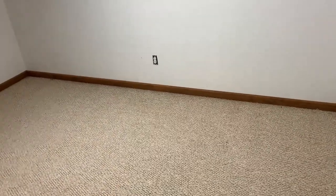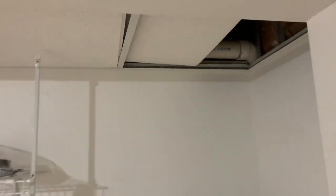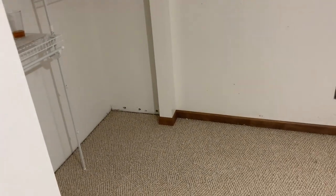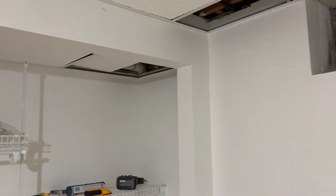The main reason I chose this room is because it has access to the outside for ventilation, and up here I have a bunch of existing plumbing I can tie into. All the plumbing is higher than the sink will be installed, so I went ahead and bought a pump to pump the water up into the existing plumbing. We also have copper in the ceiling, so I'll have to do some copper work to install the new sink as well.